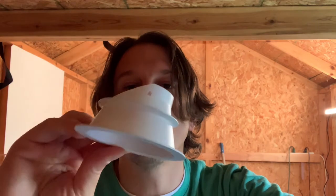There is some clipping up above the trim, so you're going to want to be aware of that depending on your beam spread and what you're specifying. You'll also notice that on the trims for these there's a cut cone. The maximum marked tilt on these is 45 degrees — and if you're specifying a 45-degree tilt, there's going to be some clipping at the top and bottom of that image. Williams compensates for that by cutting back this cone a little bit, which means you will be able to see up into the aperture from directly below. It's not a closed housing unless you specify an IC housing — it's just an open tray.